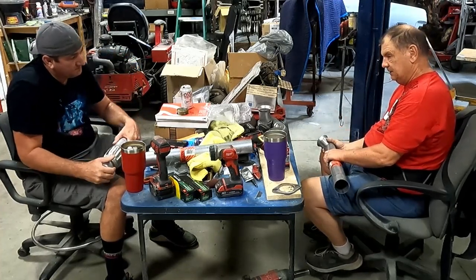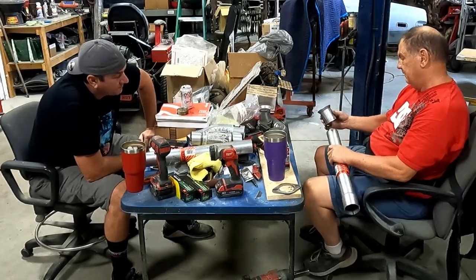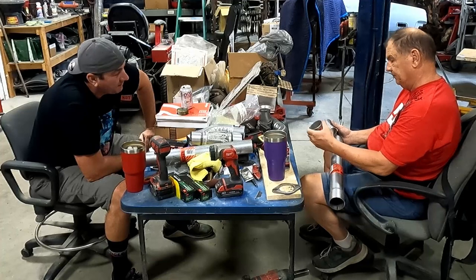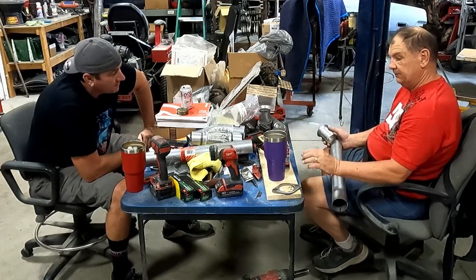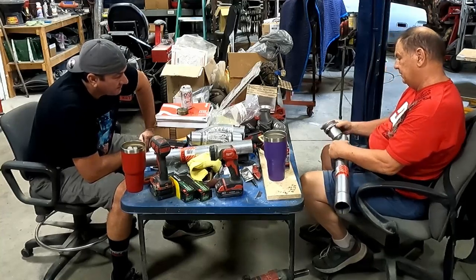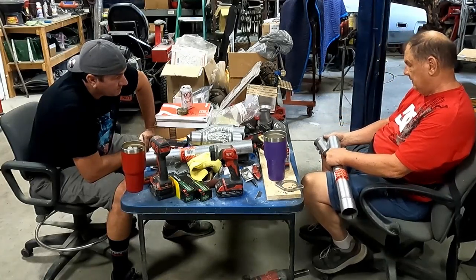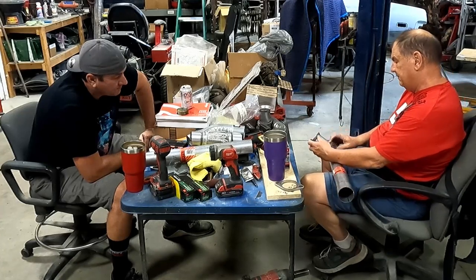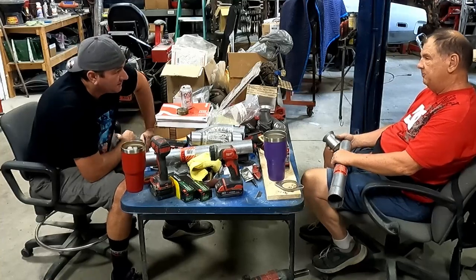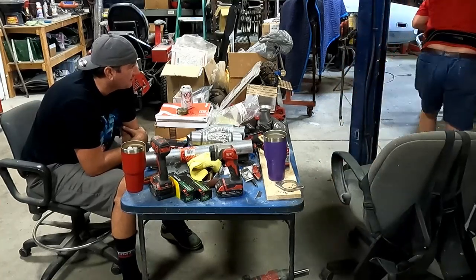That, I guess, would be... Okay. Well, then we can use this pipe. And this one is cut off because we cut the flange off. That's all it did. Cut that flange off. That was what was keeping the flange on there, right? So this has to go on there first. When we weld, yes. And then put this on. So we can use this to do our marks to cut our 45 here. I say cut the 45 in the next piece. Or not 45, but depending on the height, do our 90. Yeah, two 45s is equal to 90, and we should be good to make a corner.